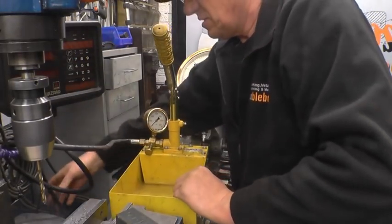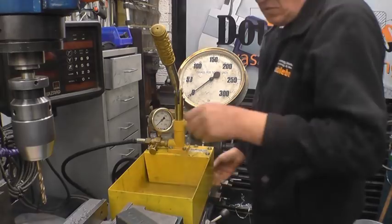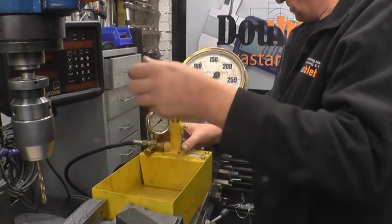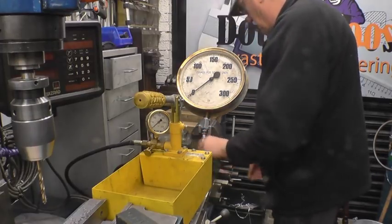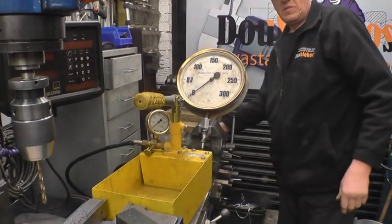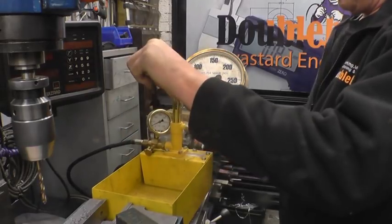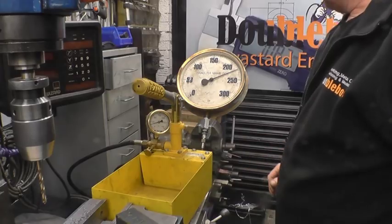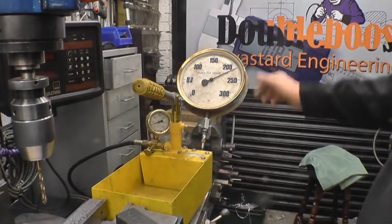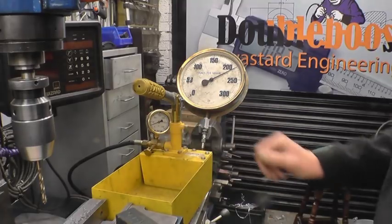I've got a test pump here. I'm going to pump some water through to make sure there's no air in there. Right, crack that rod — there it goes, that's not going to move for a long time. And look at the gauge on here — it's showing the same reading as the reference gauge, which is exactly what I expected it to do. It's creeping down because it's actually leaking back through the valve.